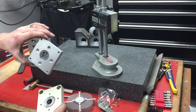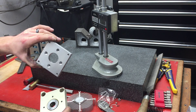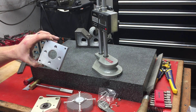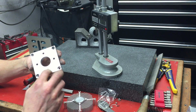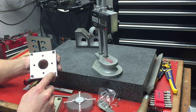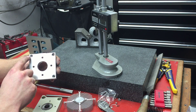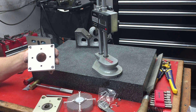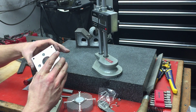Haas gave on his drawings a layout on the same part for both NEMA 23 and NEMA 34. You'll notice on these far corners here you'll have some holes close to the edges. Those are for the NEMA 34 motor, which I'm using — the 906 ounce one, something in the 900 range.